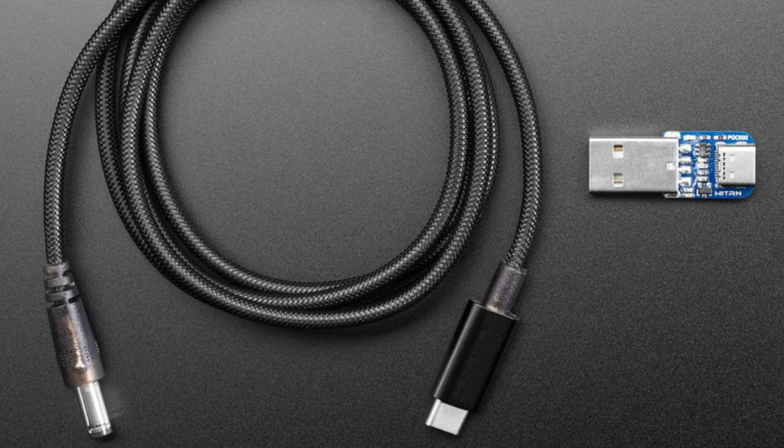And you program it with these little code chunks. They're not EDIDs, but they kind of feel like EDIDs. And then the cable turns into that cable. So one day you can have it be a 5-volt requester cable. The next day it's a 12-volt. The next day it's 20. You can have it request the highest voltage or the lowest voltage, whatever. There are different programs that you can program it with.